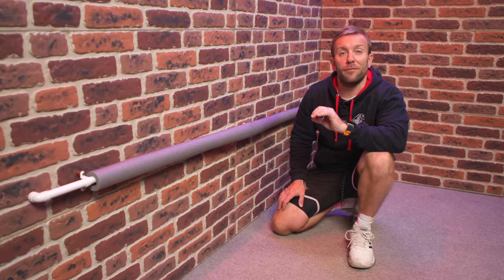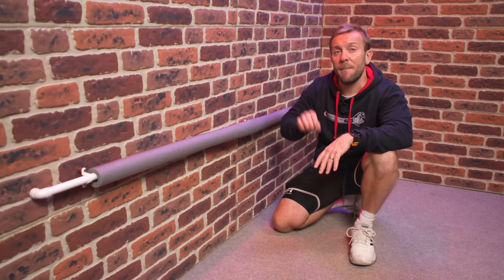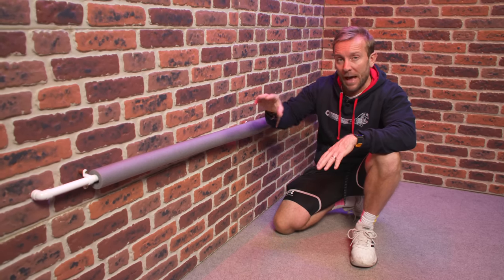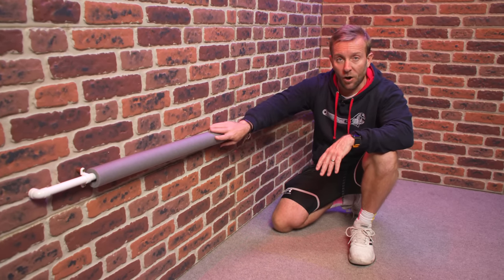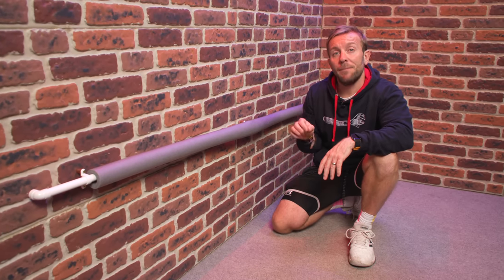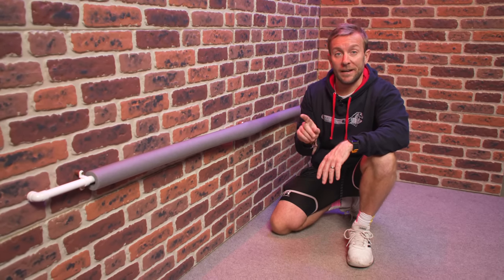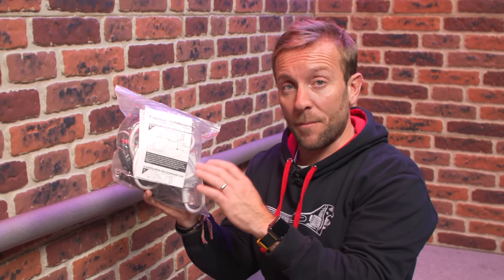You've watched this far - I'm now going to give you the best thing you can do to stop this from ever freezing. We've stepped the pipe out and insulated it, but I remember a time about five to ten years ago where it was minus five degrees for about two to three weeks. It doesn't matter how good your insulation is then - if it's that cold for that long, the cold is going to beat the insulation. It's going to turn the insulation to minus five, and in turn that's going to turn the pipe to minus five, and it will freeze. So we need to put an electrical component along the pipe to keep it above zero degrees - but only when it goes below zero, so it's not on all the time. We call that trace heating.